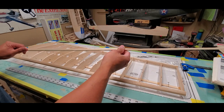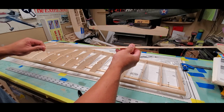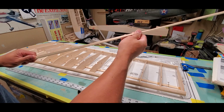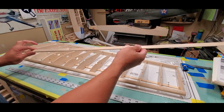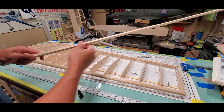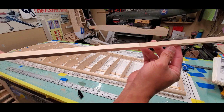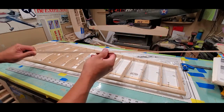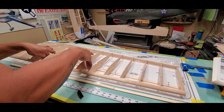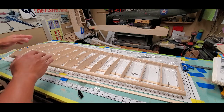First, we basically prepared four main spars, and this is built up with three pieces. We got your small, medium, and large portion of your spar. We glued that, tapered the short and the medium down, as you can see right here. And from here we made four of these. So we got your main spar cross pin over the plan, and then from there we prepared the ribs.